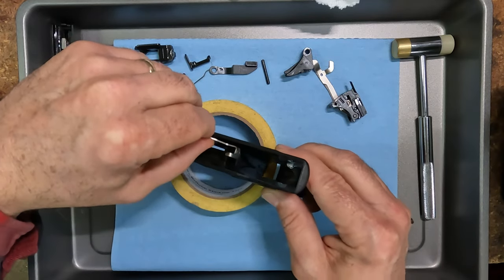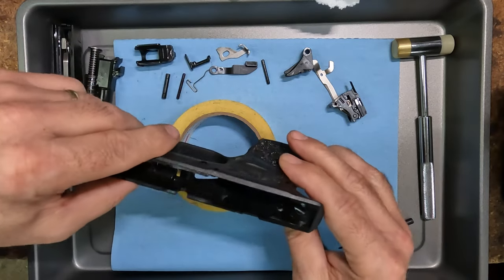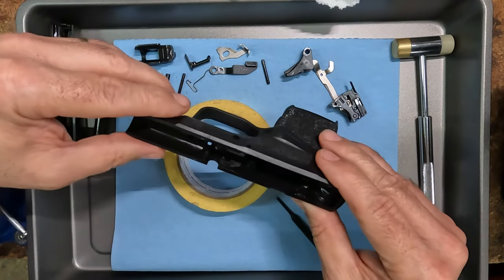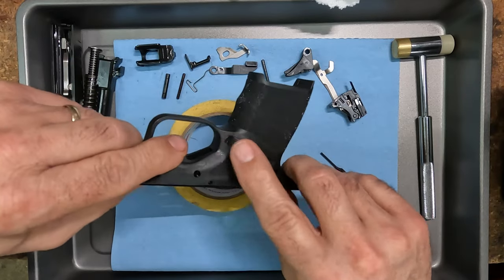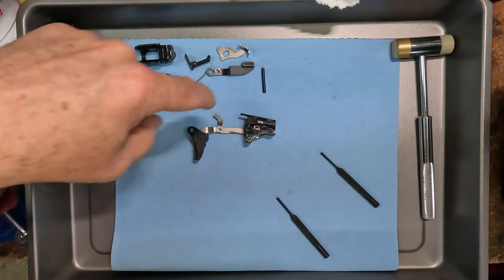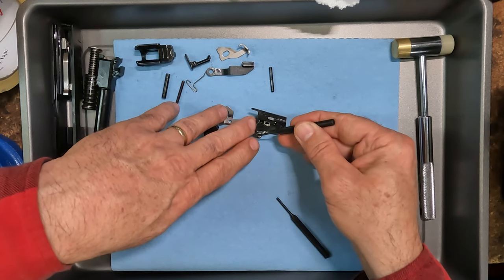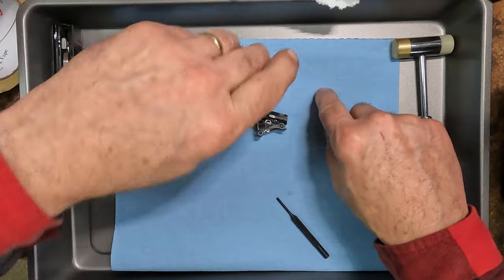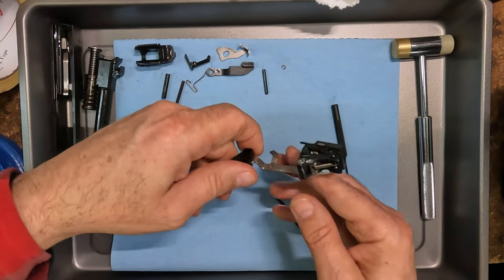From here, this is your mag blocking lever as I think they refer to it. Look at there — you can see some residue I didn't get completely cleaned out because I didn't take it completely apart before. You can see the white lithium — they love their white lithium grease. That's the whole frame. The next thing to take apart from here would be reversing your mag release. There's one little trick here: this pin is retained with a little clip. You've got to be mindful of this little clip — reach in there and pull that little fella out.